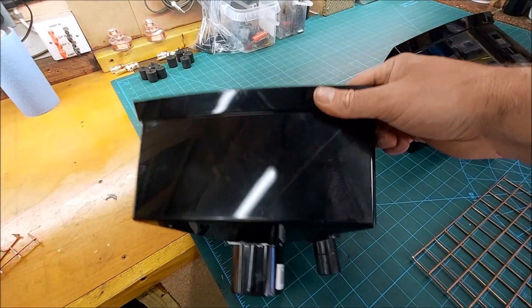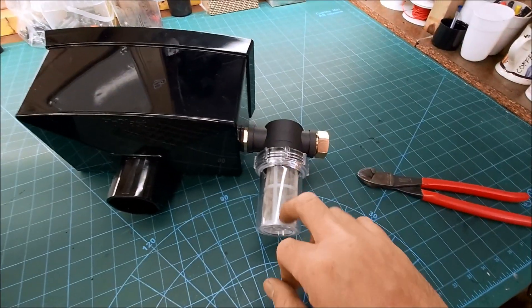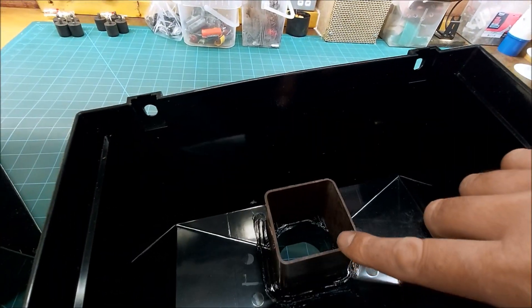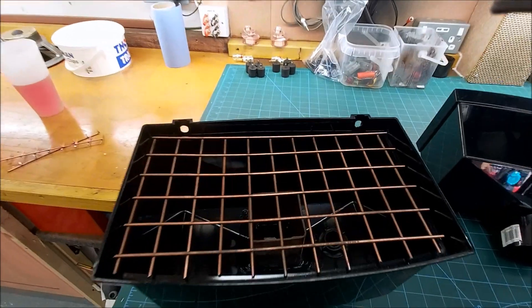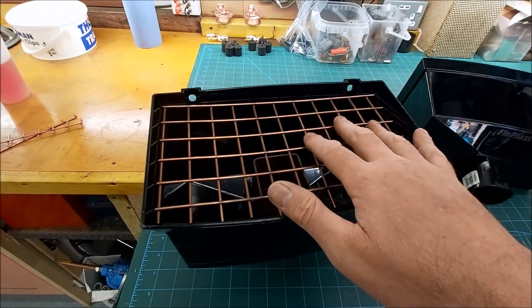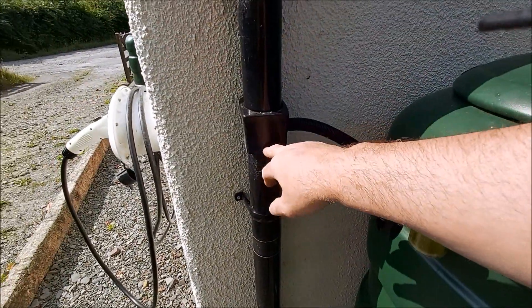This particular one is on my workshop and there's just no room to have the filter fitted to the rainwater butt, so I've screwed it in here instead. Same thing really - once it gets up to a certain level it'll overflow. I've got a coarse mesh that goes over the top, more as a leaf guard to stop all the really big stuff - 25mm square. I might do something finer but I don't want this to block. Those hoppers are going to take the place of the original fittings that tend to block up quite easily.